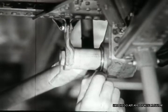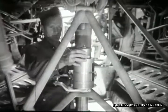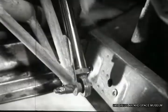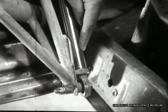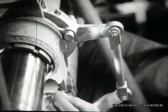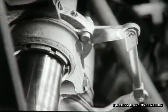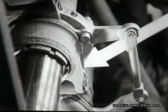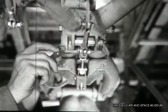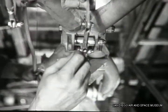The feeler gauge must not enter the fitting of the rear drag link. Make sure the shimmy damper is in there securely, and the jam nut on the ram must be tight. We want no clearance or binding between the lower V and oleo struts — the same applies to the shimmy damper ram, top and bottom; they're behind that strut. In checking the lock linkage, Chandler looks for proper safety, then makes sure there is correct clearance between the latch plate and latch, and again between the forward knuckle and the latch.